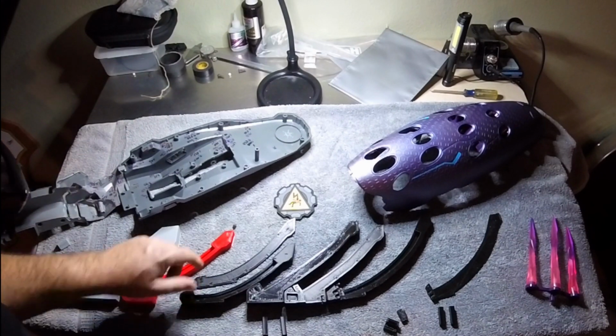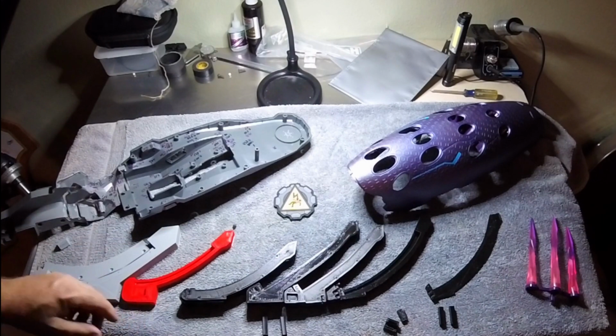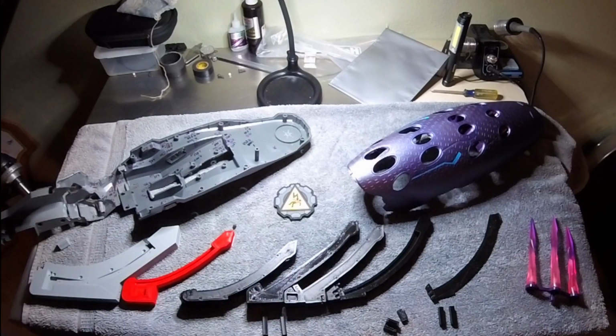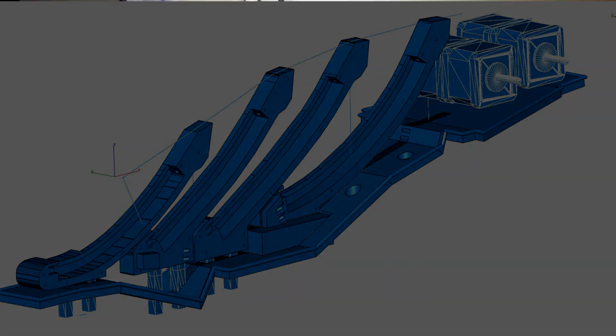So you see here what I hope are all 4 final designs for the needle carriers. And notice there's a massive difference between each and every one of them. Entirely a scratch design to get them to work. And they'll use these 4x4 pegs to fit into a chassis that goes along the bottom of the upper shell. And that should allow us to extend and retract the needles to get them to fit fully within the upper shell.